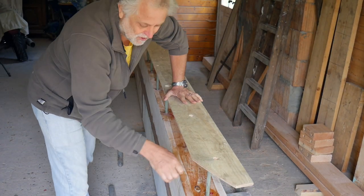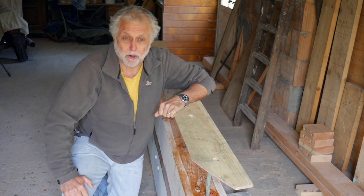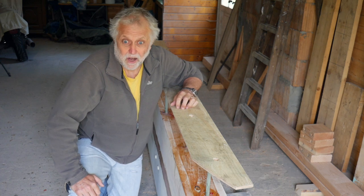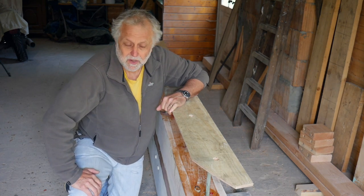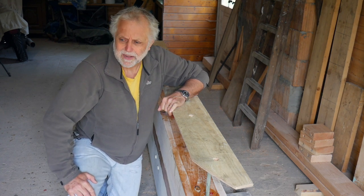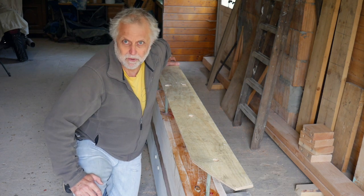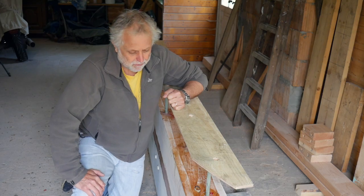It marks the exact positions of the bolts, and then I could lay under the boat, get it up in position, which is very difficult to show you. In fact, I've put a couple of screws through it, screwed it up into position, and checked the hole positions under the boat, and then inside, of course, in the boat, it's very, very easy just to lay it on. And the result of that was that I took out some of the holes, made them a little bigger, out to 25 millimeter, four or five of them, just to make sure that the keel bolts would come up through.